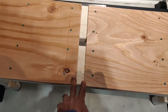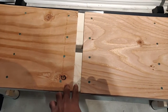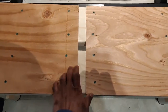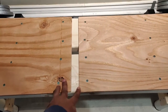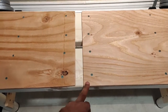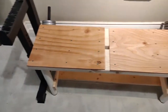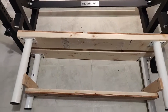I'm planning to fix that gap once the weather improves — I'll cut a small piece with the same grain orientation and glue it in. The plywood on top is more cosmetic; I could have managed without it. Before screwing it down I applied a little wood glue to make sure there are no gaps, then put in the screws. I'll turn it upside down now so you can see how I constructed the legs.